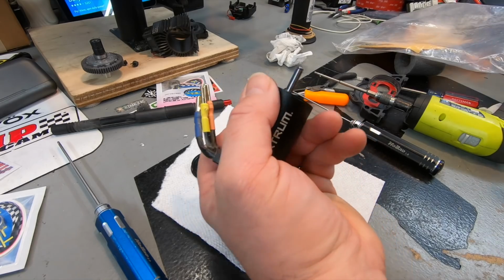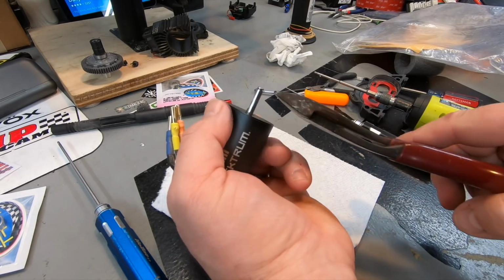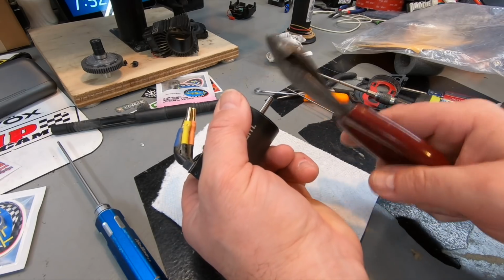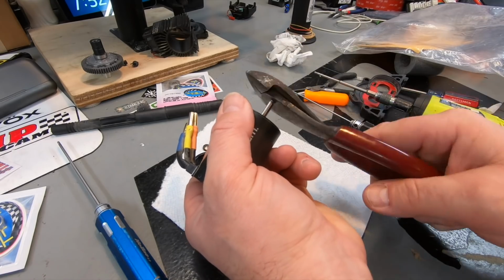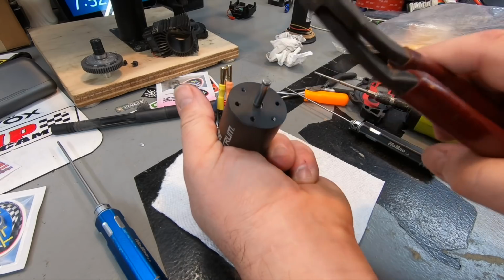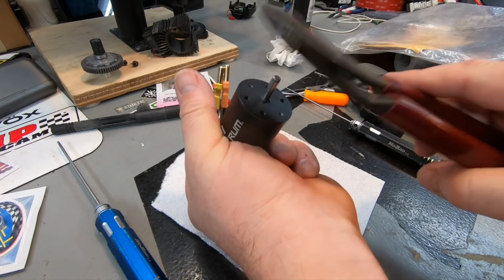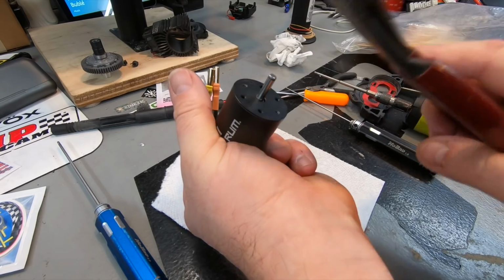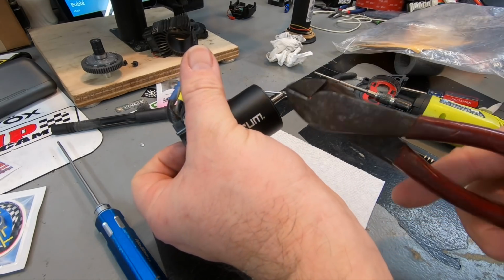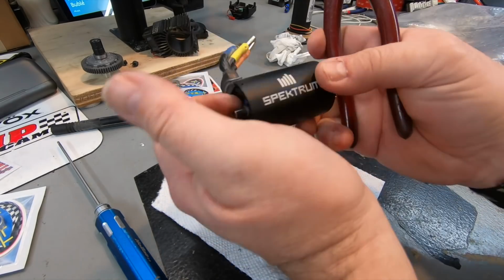So I'm going to give this a couple of wraps. Hopefully the bearing stays with the shaft this time, because in the past it hasn't. I'm hoping that the bearing pops out with the shaft. That'd be great. That's why I'm giving it light taps. I'm not trying to peen over the piece there. You can see it's coming out.